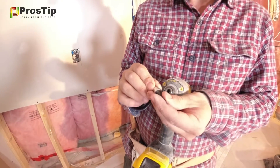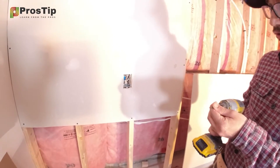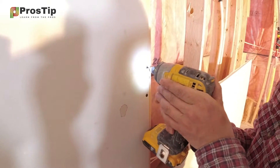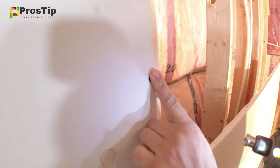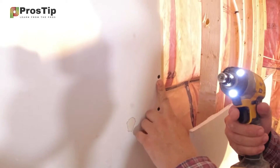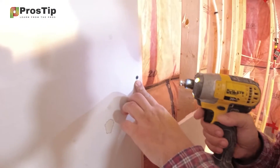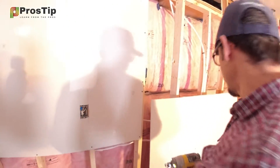For example, if I add another screw here — you can see it's kind of flush with the drywall. If you're not using a depth-stop bit, be very careful that you don't send the screw all the way in. So let's install the piece.